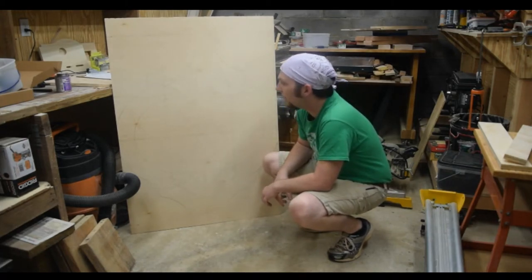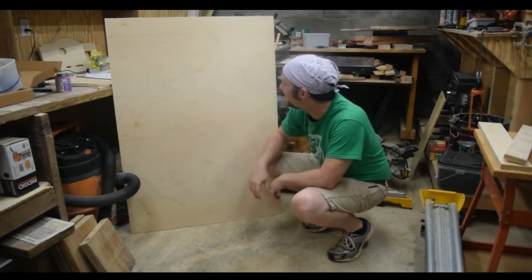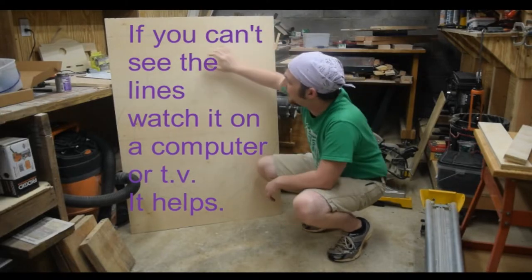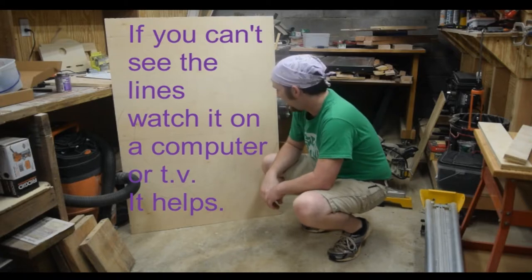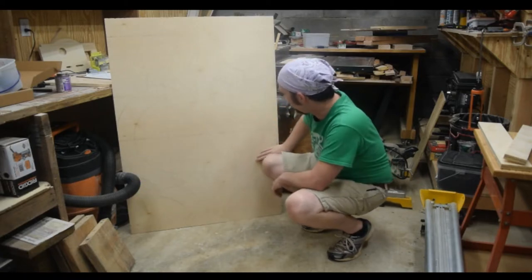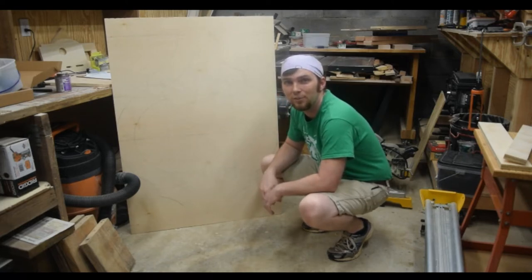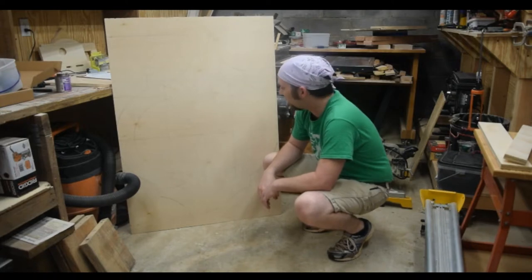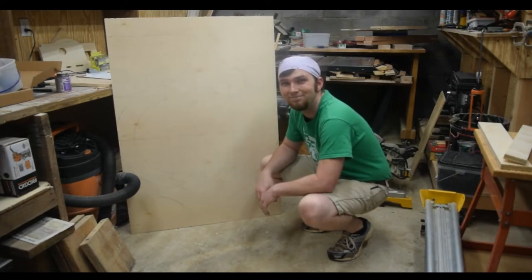Using a framing square and a couple impromptu compasses, I laid out this Moroccan design. Since the corner of the rectangle is the center of another shape, I laid out the adjacent pieces as well. I wanted to make sure the void in between wasn't too big or too small, because that's the part that'll actually get painted. The next step for me is to cut it out with a circular saw and a router, but you could do it with a jigsaw if you took your time.